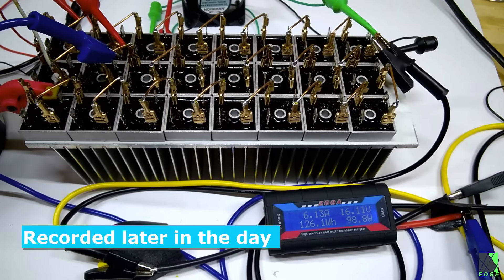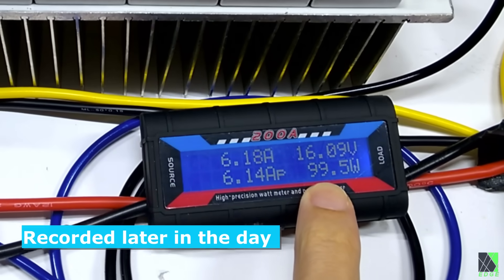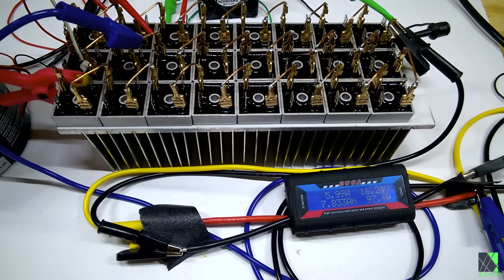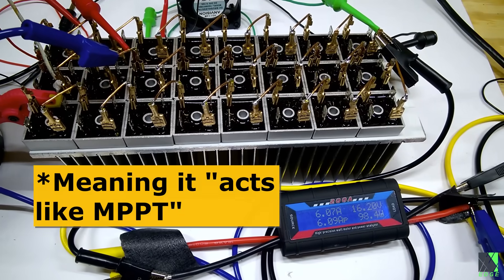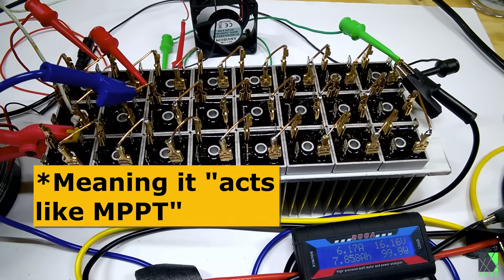And back to the other heater I have for my Powerwall — this one is now consuming about 99 watts, but I can make it consume more if I want to. So this diode heater will sit here all day making me heat, and I can change the amount of heat that I get. It automatically regulates. It's basically a maximum power point tracking circuit for heat, but without any of the complexity that maximum power point tracking circuits always bring with them.